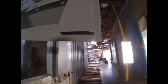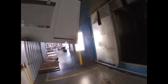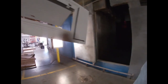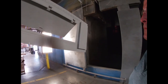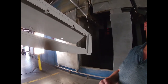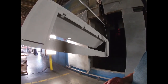So this isn't cured yet. Once it goes in the oven, it's heated to roughly 390 to 430 degrees — more depends on the thickness of the steel. As it bakes, it cures and makes it hard, and it sticks to the steel to where you can do an impact test. You can bend it and it will still stick to the steel.